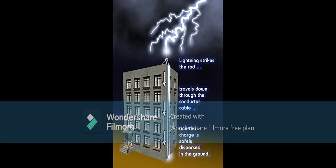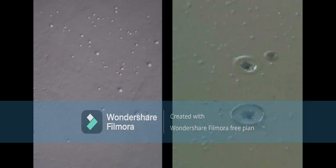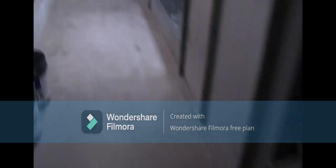Without proper grounding, charge can build up in the part, actively repelling the powder, creating what we call fisheyes or craters. Charge could build up and shock someone. And without appropriate grounding, there's simply loads of powder that fall to the ground wasted. To avoid this, we need to maintain the chain.